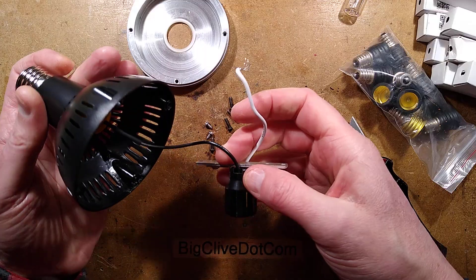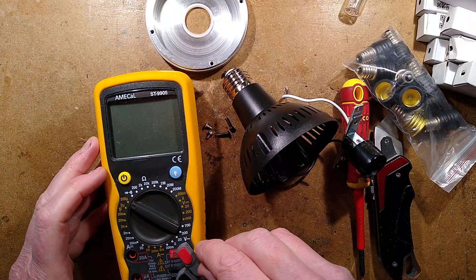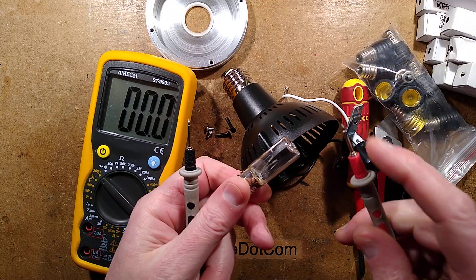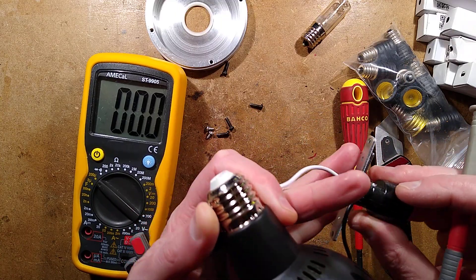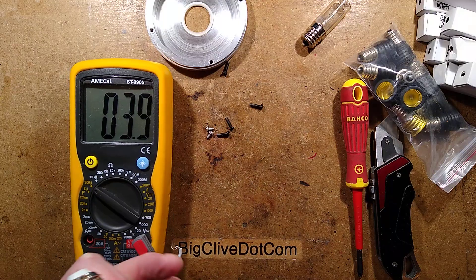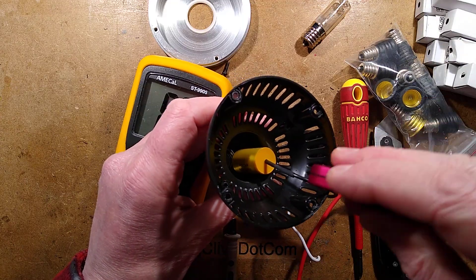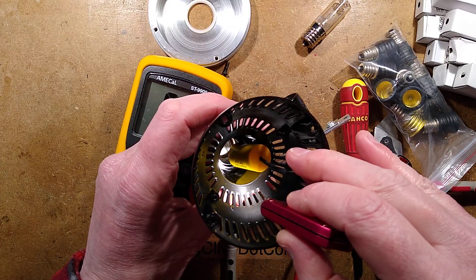That means I can measure this capacitor. I'll bring the meter in, set it to 200 mF optimistically. I'm always a bit cautious about capacitive droppers and capacitive limiters — it's basically just a capacitor that drives the lamp. The capacitor is going to this connection. It's quite a high value — it's 4.2 microfarads, 400 volt. Ew, spicy!